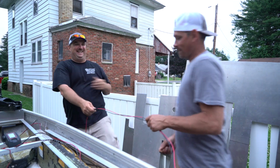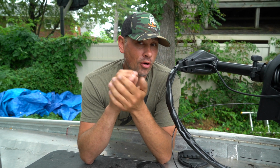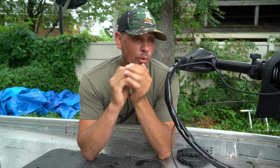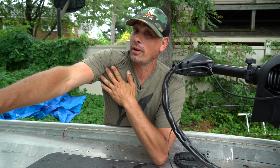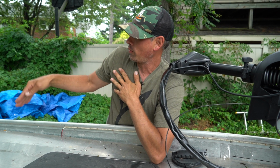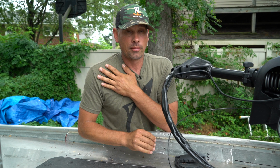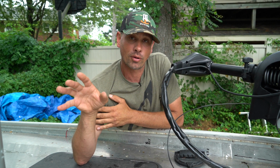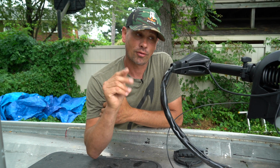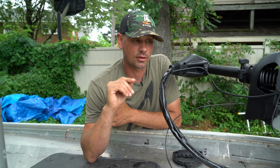Another thing I want to address is the wiring for the trolling motor and the wiring for the depth finder. First off, the trolling motor, we use 6-gauge wire. We ran our neutral leg around the boat this direction. We caught our first battery over there on the negative terminal, ran in series over here, and then caught the positive leg on up to the trolling motor. We also worked in a 50-amp trolling motor breaker over there. So if you run into any issues, it gets hot, it pops the breaker before we start frying stuff.